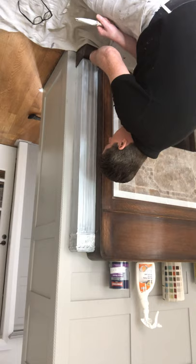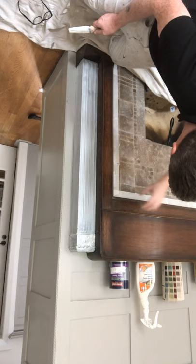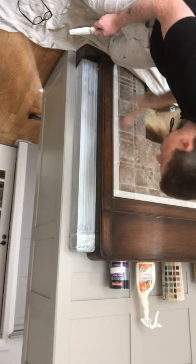As I say, when you're doing an old fireplace like this, this is real quality. It's a hard, solid wood. There's sections in it, a separate section there. For example, here, this middle section has a grain in it, and just in the corner here, there's a separate piece of wood with the grain going down that way. So I have to follow that grain there and then bring it across as well. So you really do need to be careful when you're doing the likes of this.